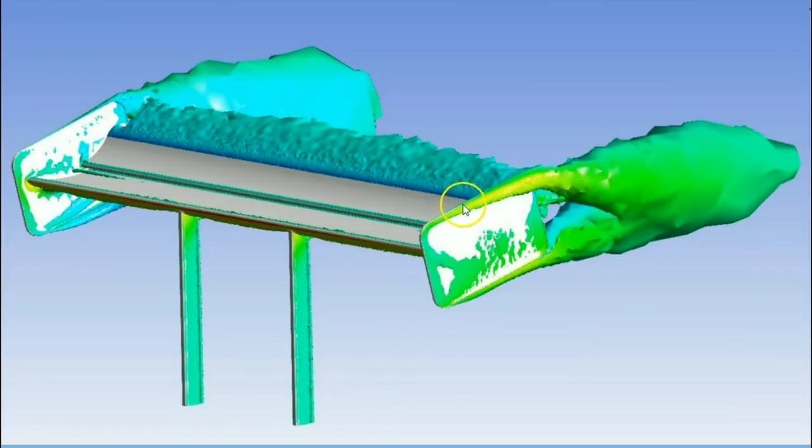Here's a look at the wing tip vortex that forms because of high pressure air on top of the wing and low pressure at the bottom. The whole point of the end plates is to block high-pressure air from escaping over the sides and making its way underneath the wing. Even with end plates, air still tries to go over the end plate and around it, causing this vortex. Evan suggested putting much bigger end plates at the end of the wing, angled higher from the back, which will dramatically reduce the wing tip vortex so much less air spills over. For the final end plate design I'm definitely going to take cues from this, and I'm also planning to make the final end plates out of carbon fiber rather than aluminum.